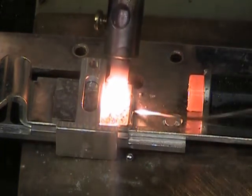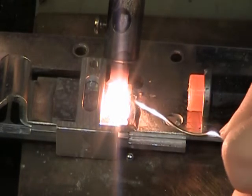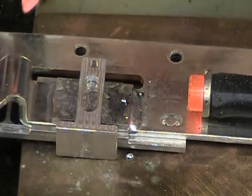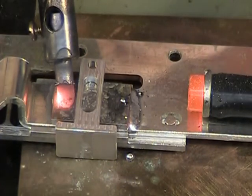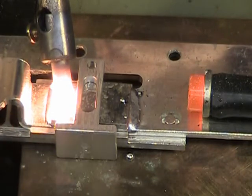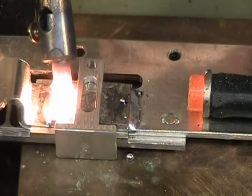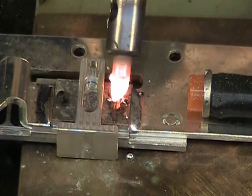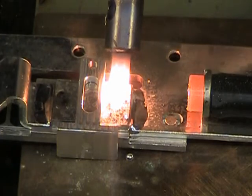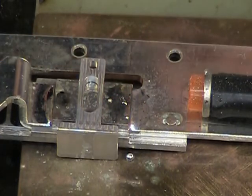Now what's going to happen is, as this gets hot enough for this solder to flow, the liquid solder is actually going to help transfer the heat down to the lower plate. Now I'm going to switch hands here to be able to feed this without being in your way. This side is going to heat up a lot quicker because it's already got a lot of heat transferred from the other side. What I'm doing is watching the bottom plate there to see how well that solder is flowing and wetting, and that's going to help me determine how much solder actually feeds up underneath to fill those voids. And you can see that solder just suck right up underneath there with capillary draw. And that completes the cycling and the application.